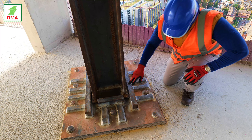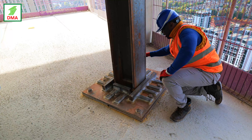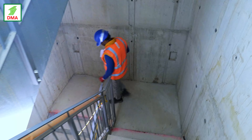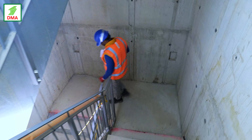Another innovation we introduced is a floating joint between the base plates. Conventionally, a welded stiff or semi-stiff connection would have been used. Today, the crane is going to be climbed, which means that new ties are going to be installed in this crane post support to support the crane. Typically, in a steel post base plate connection, it is normally welded all around.